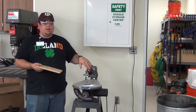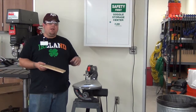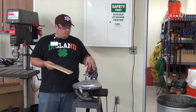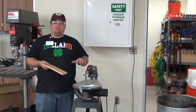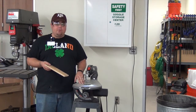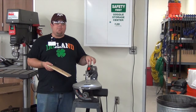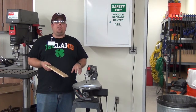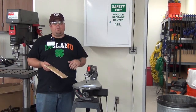The switch on here is somewhat similar to the switch on the table saw — it's very easy to turn off but slightly harder to turn on. As with all tools, after we plug it in, we want to make sure it's operational, so we'll turn it on. This is a medium speed — you can see the saw is not very loud. We can dial this down to where the saw is making nice even strokes, probably a little bit faster than we could do by hand. Then we can turn this up — anytime you're making these adjustments, don't do them too rapidly. As you can see, we can get this up to a very high rate of speed that's going to allow us to go through material relatively rapidly.